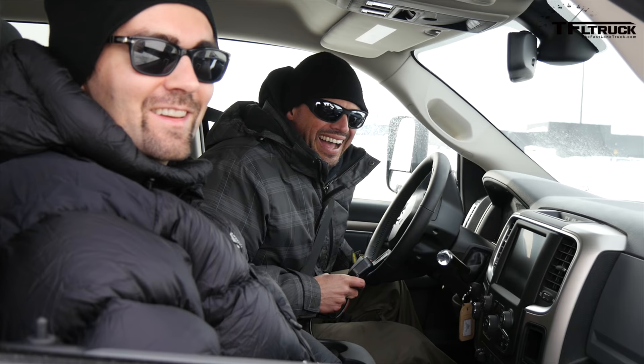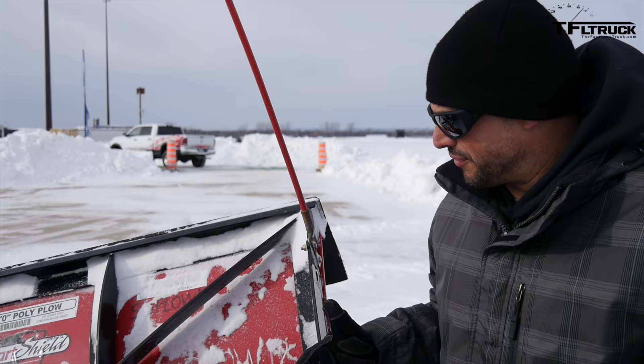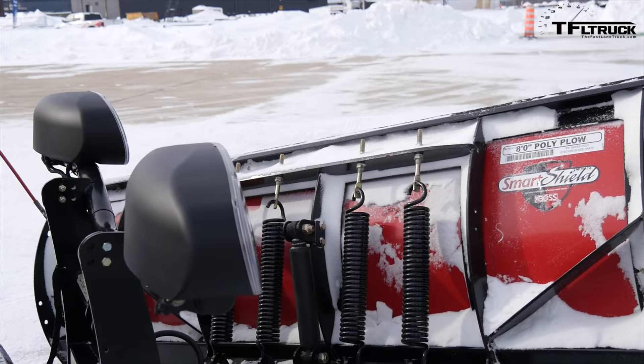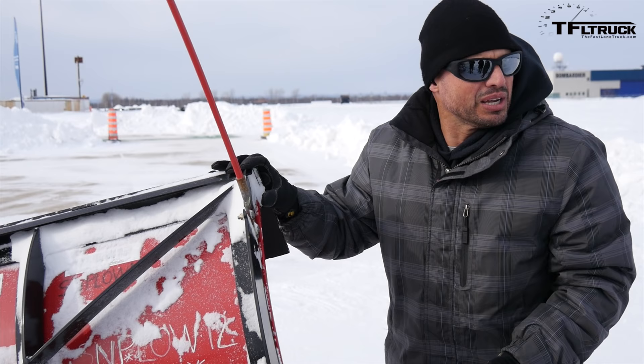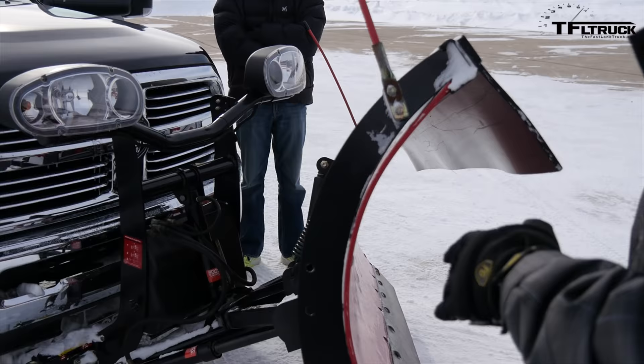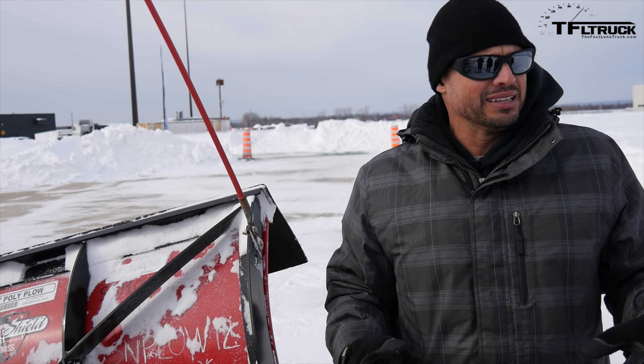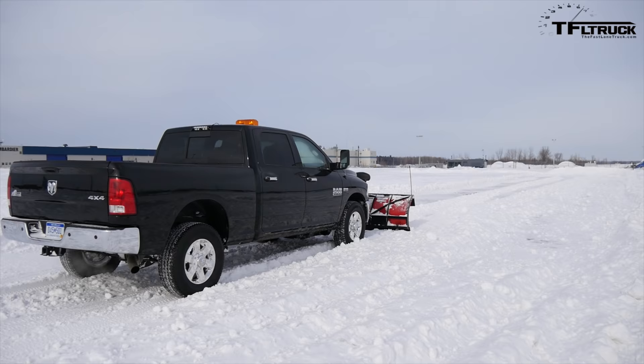We were reminded that ice becomes boulders at speed. The blades have protection systems so that if you overload them or strike something hard, there's no damage to the truck or plow. The heavy-duty springs you see here allow the blade to buckle forward if it strikes something sharp like a manhole cover, ice, a rock, or a curb. If the blade is angled and you strike something on the raised side, it'll fold back and hydraulic fluid is pushed back into the reservoir, saving the plow. These safety systems are critical because when you're plowing, you don't always know what's underneath the snow.